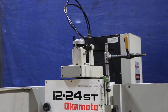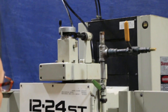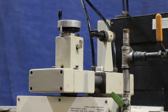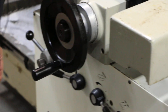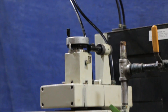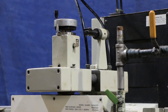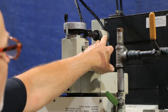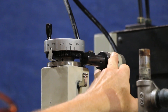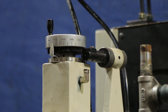This machine is equipped with an over-the-wheel dresser and it's currently wired for 220 volts. When you want to dress the wheel, there's a knob here to slow the feed down. When you go back, the dresser automatically advances itself for the next time you dress. This piece back here is adjustable — there are a couple of knurled nuts on there so you can adjust the length that this sticks out, which will change the amount that it feeds each time.